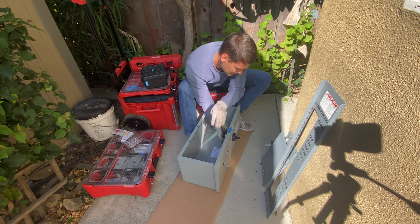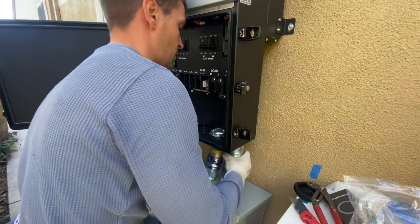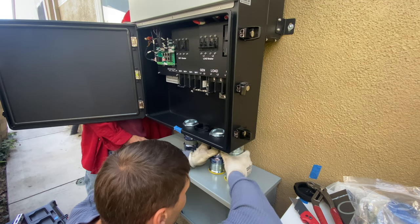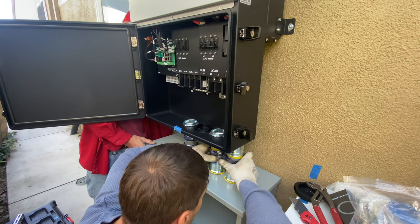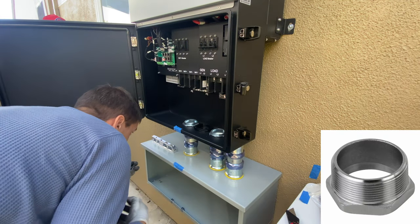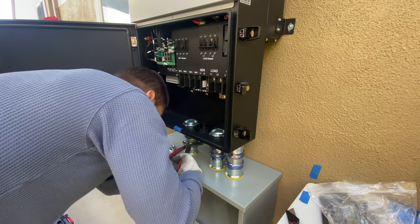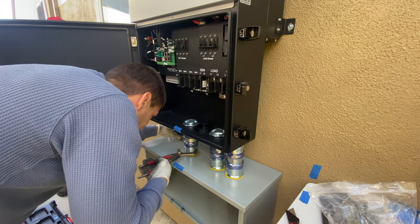The second difference is the hole for conduits — with the Lux Power we have two inch, and with the solar we have inch and a half, so in theory we can install fewer nipples for the Lux Power because we have larger conduits. The third item I realized after installation is that we can use chase nipples and install the wire way just below the inverter, because behind the inverter there is a niche with a lot of space for cooling fans to suck air and cool down the inverter.